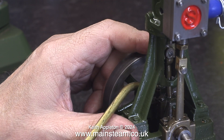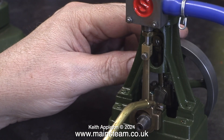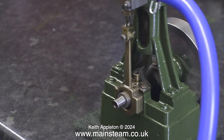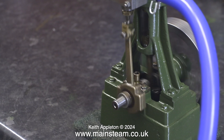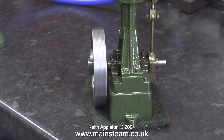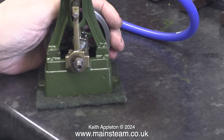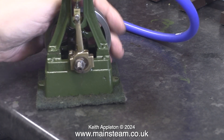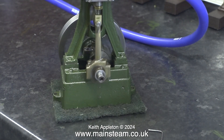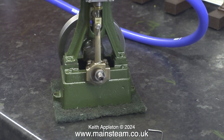I've been a bit paranoid — I don't want to damage the engine by running it dry, so once again I'm applying even more oil to every moving part that I can see. I've connected my compressed air line, and when I turn on the air, the engine bursts into life. It didn't run like this when I first received it. With the odd-shaped inlet ports on the valve block caused by the drill bit coming through at the wrong angle, the engine is more advanced than usual, but this is a good thing. Admission is before top dead centre slightly more than I'd like, but generally speaking steam engines run a lot better with advanced valve timing. The strokes are positive and the beats are OK.